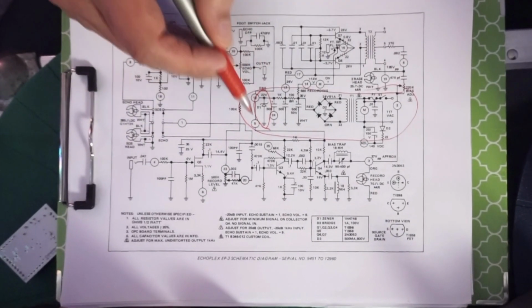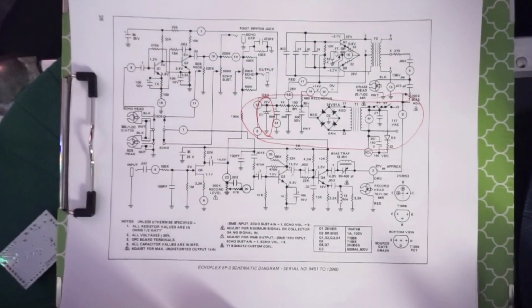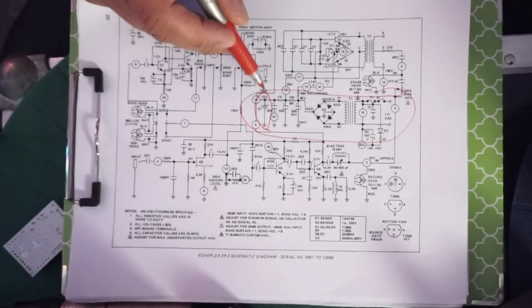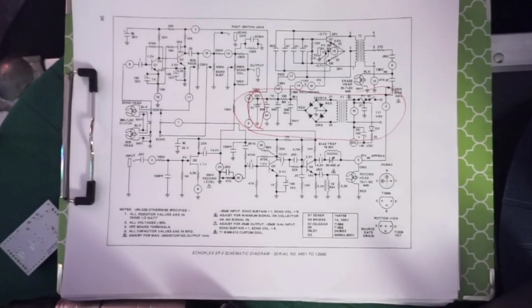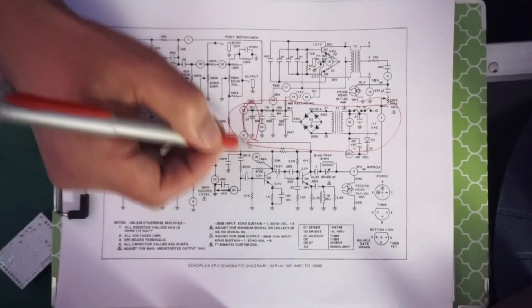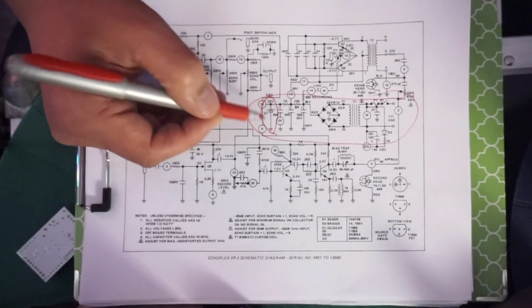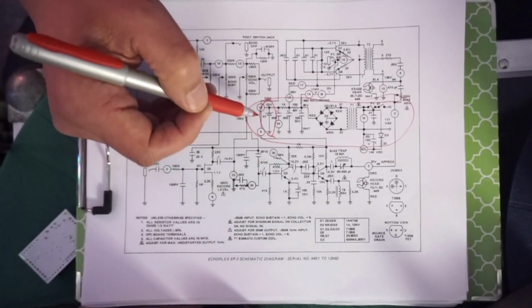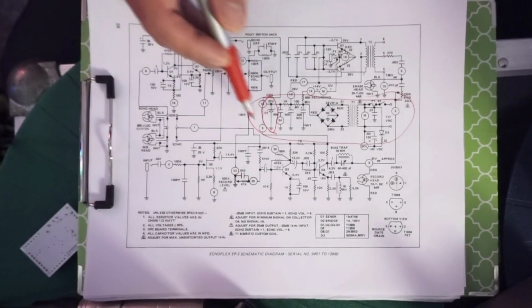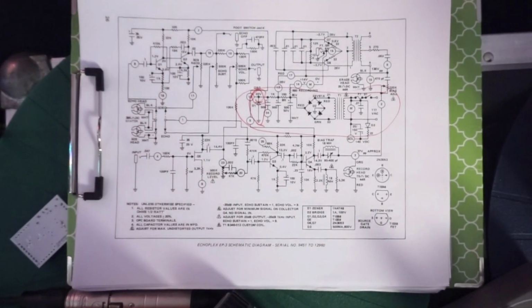And we're doing the exact same technique on the Epoch Deluxe, because I found in my experimentation on the breadboard that doing it this way, using a shunt regulator, it's not as efficient, because you're basically overshooting the voltage and then it's draining off this diode. So it's always kind of sucking juice. Not too bad, 200 milliamps max, whether you're playing or not. But that's part of the feel thing. Anyway, that sets up the 22 volts that feeds all the gain stages.